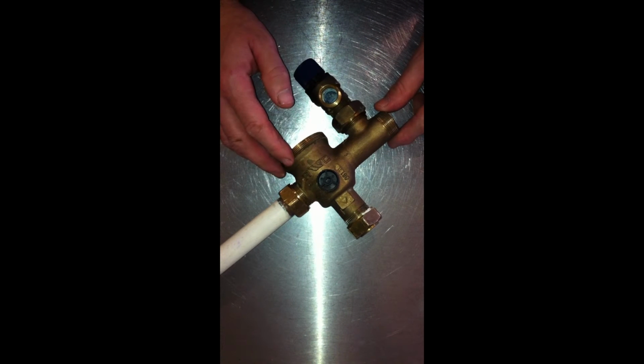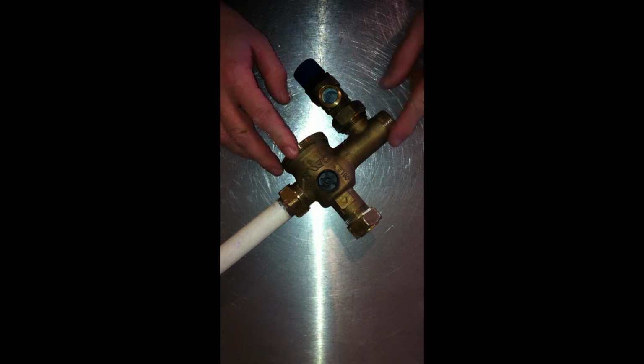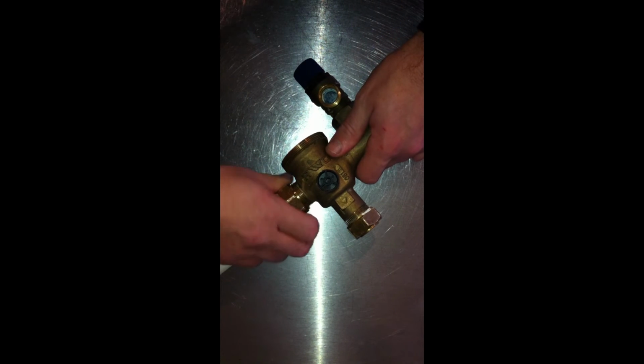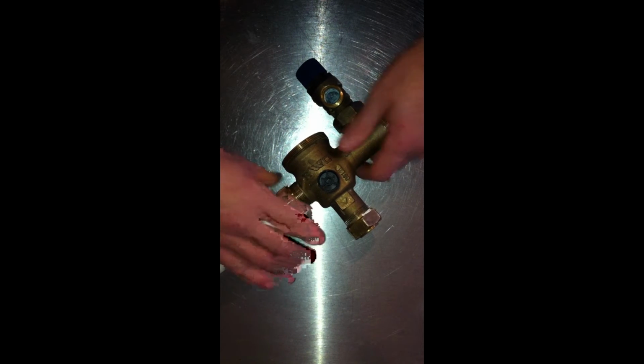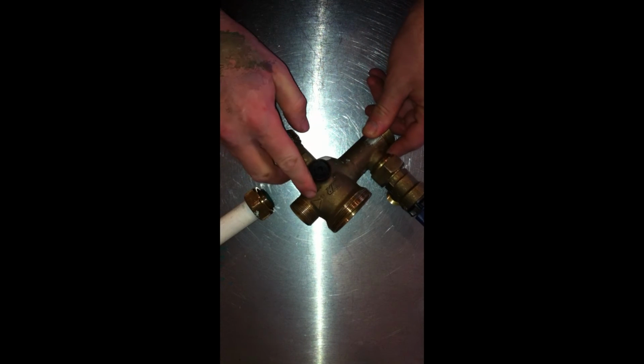Anyway, in my case, this basically is going in the bin, and this needed to be replaced, and it's known as a pressure reducing valve multi-block in the case of OSO tanks. The valve is obviously fairly simple. You take the retaining nut from the pipe that goes into the water tank itself, the retaining nut that holds the discharge pipe that connects to the tundish, and the top retaining nut, which was basically the cold water inlet feed. And the cold water inlet feed will obviously always follow the line of water flow as demonstrated normally on the valve itself. In this case you have an arrow on the back showing you the direction of water flow through the device.